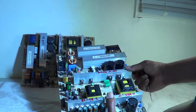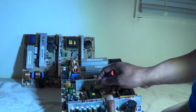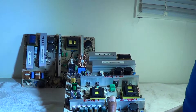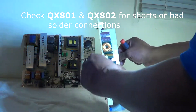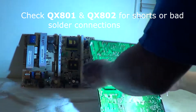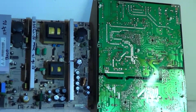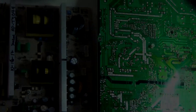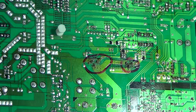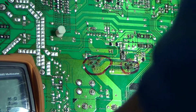This middle row right here — with these two FETs and two smaller ones — check these two smaller ones first, because most likely those are the problem. I've circled those two MOSFETs and they are definitely shorted.